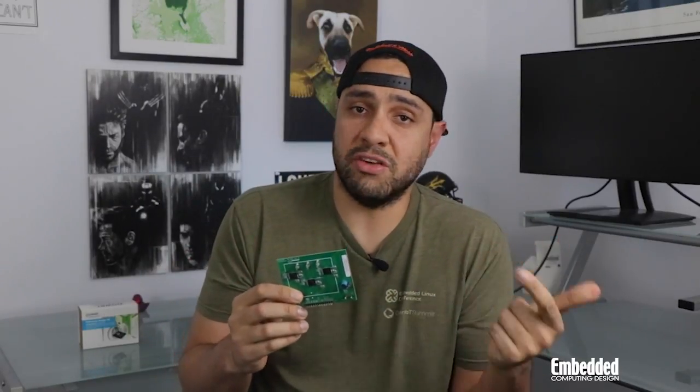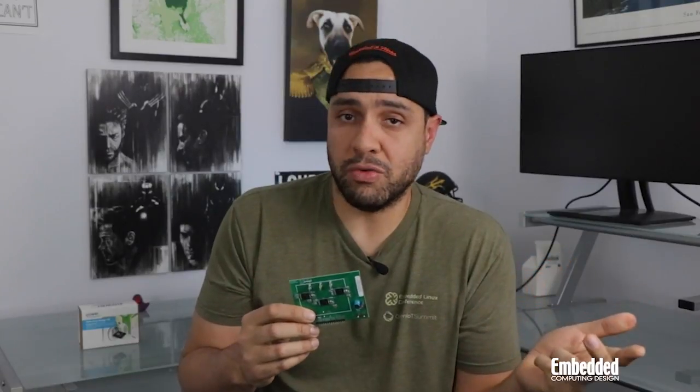The low frequency also means that you can work with off-the-shelf inductors, which are usually low cost. Like its sister part from Power Integrations, the LNK3204D packages a lot into one part, including an oscillator, self-biasing, input and output over-voltage protection circuitry, and reliability features like frequency jittering, hysteretic over-temperature protection, and so on.